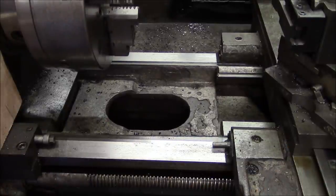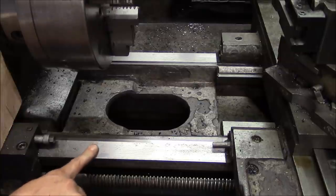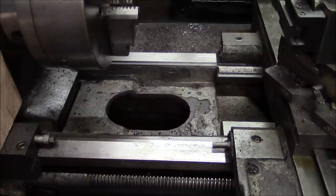Next I'm going to check the bed ways. The best way to do it is just kind of visually. There are some marks here but no deep gouges, and same on the flat way in the back. I would say this set actually has pretty minimal wear on the bed itself. These are hard ways — though that's Chinese hard, so take it with a grain of salt.